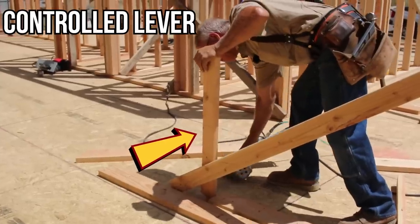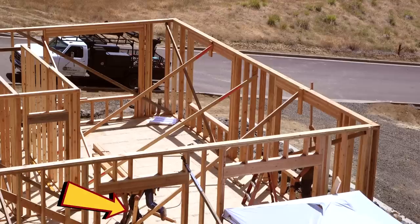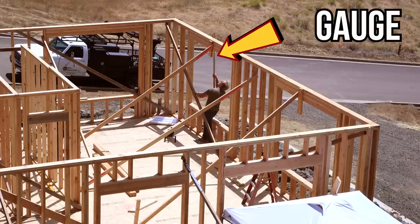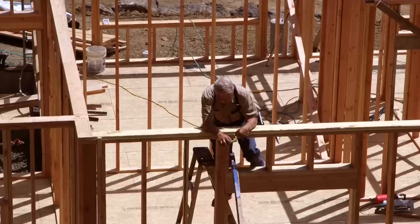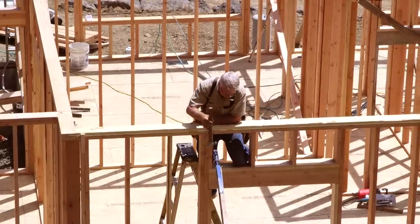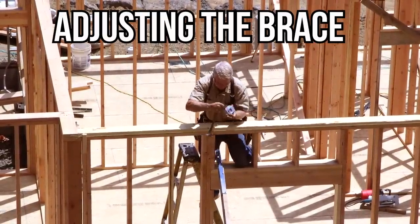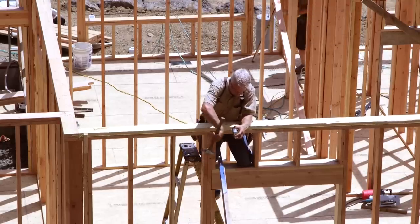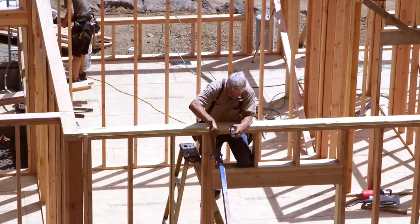A lot of times, and especially for new framers, getting things perfect can be frustrating. You might go around and around adjusting and pushing and plumbing your walls and discover that you're fighting and wrestling with the same 1/8 inch error and chasing it all the way around your building. Generally, there are two ways that these errors can happen. First is that there is a big and obvious mistake in the length of some part of one of your walls. Maybe you cut on the wrong side of a line. Maybe you're 1/2 inch off right there in that spot.